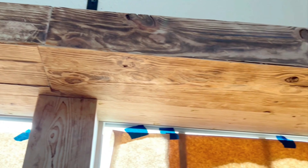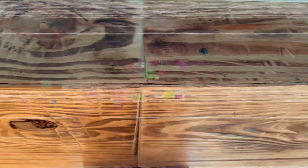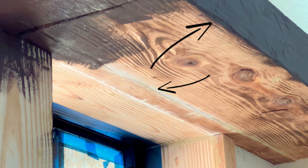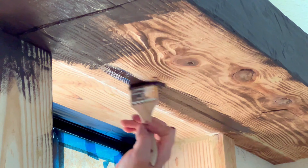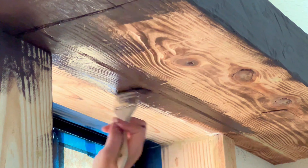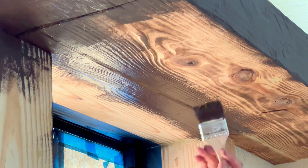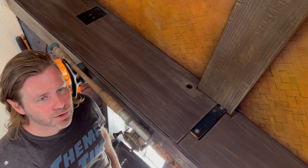Here's the framing after being skinned with ripped and weathered wood panels, just like the post below. One area looks a little sloppy, but that section won't be seen because I plan to eventually cover it with a corbel. However, the exposed area still needs to be addressed — a little wood putty should do the trick, or if you're like me and ran out of wood putty and are too cheap and lazy to go to the store, use drywall compound. Once you paint it with scenic treatment and give it a coat of lacquer, it'll clean up pretty nice and no one will ever know.